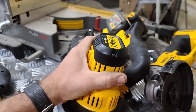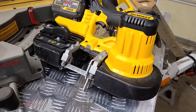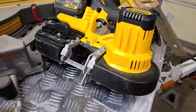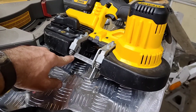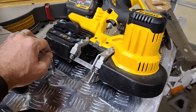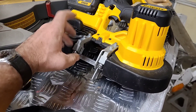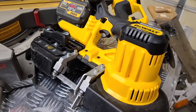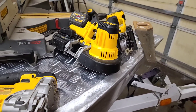If you have a lot of tubing to cut and budget isn't an issue, a portable bandsaw is a lifesaver. They're not that expensive and it's a great tool for cutting aluminum — you can also use it to cut steel. There are many different TPI (teeth per inch) blades available depending on the material. Its downfall is that you can't cut very large tubing or sheet stock, only smaller dimensional tubing — but it gives clean, straight cuts.